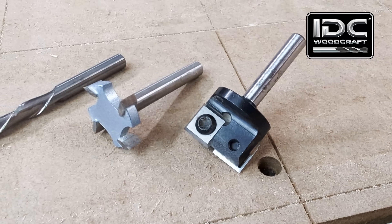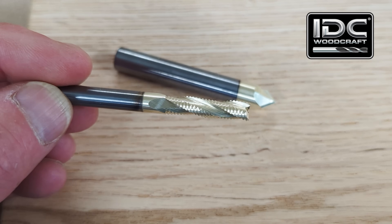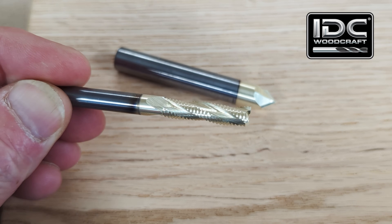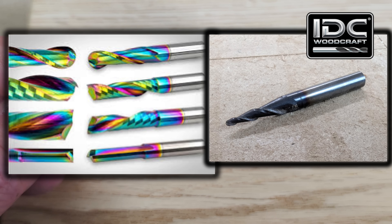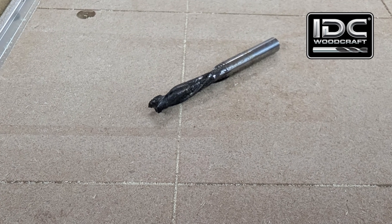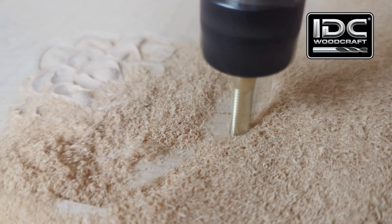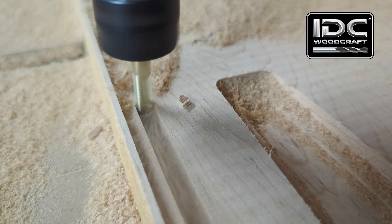These inserts and carbide are designed to handle the heavy workloads of CNC machining. Now sometimes you'll see CNC router bits that have different coatings on them. For example, these two bits from IDC Woodcraft have what we call zirconium carbon nitride coating on them. You'll see some bits that have a rainbow color coating or a black coating, a silver coating, and several other types. All these coatings are electroplated onto the CNC router bit. The coatings serve three main purposes: number one, it hardens the outer edge of the bit so it can last up to four times longer; number two, it makes the bit more resistant to absorbing heat; and number three, it adds lubricity so that chips can slide out of the flutes a lot easier.